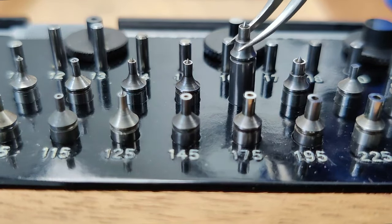It limits how far the spindle can be plunged. By turning this dial, you can precisely control the depthing of the jewel. When we rotate it clockwise, it allows the jewel to be pushed in deeper, and vice versa. This time, we're going to use a pusher with a diameter slightly smaller than the jewel's. Centering the jewel and press it down. I adjusted the jewel's depthing about 5 times before the end shake was acceptable.